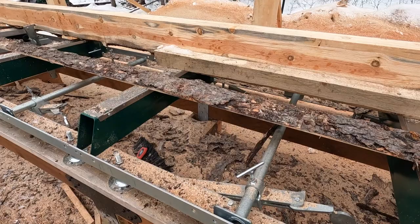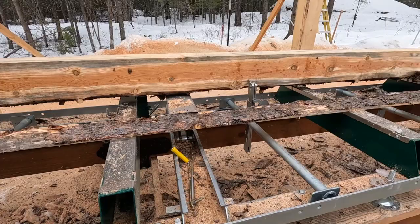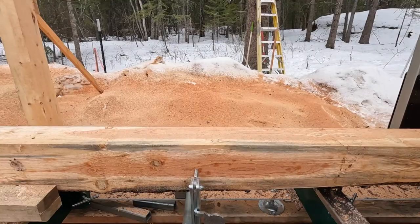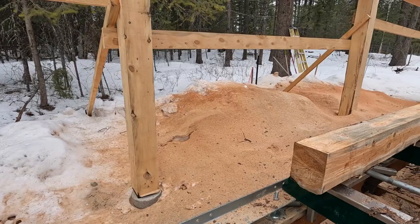When you're making that third cut on a cant, I'm using the brace down here and you're kind of sizing the log up. What you really like to see is when you shave that piece off, that it's nice and thin all the way down, yet with very little waning on the cant that you're trying to do. So that one turned out about perfect. I just got a little bit of waning or bark on this bottom end, but that's definitely acceptable.